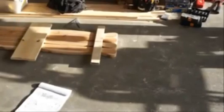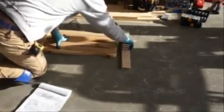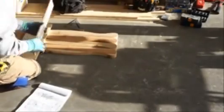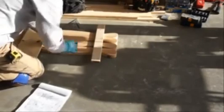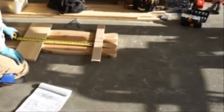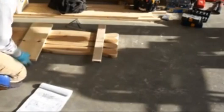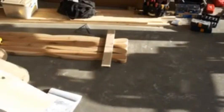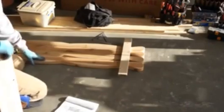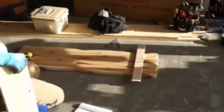So I didn't want to make this bed too big. I lined them all up. You know, you have to make sure the top is perfect, the bottom is perfect. This is what I have. This is going to be my top row. This is going to be my bottom. And this space in between, which is 18 inches or 15 and a half. I was going to use 16 to begin with. So 15 and a half inches is going to be my pickets. And all of these are marked, so you have consistency all throughout your baby crib.